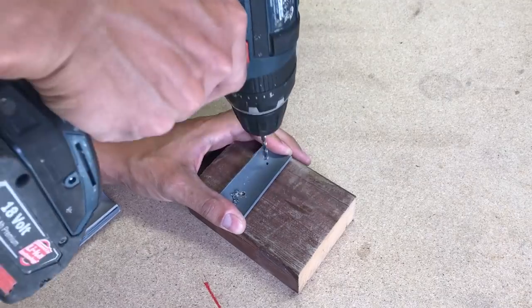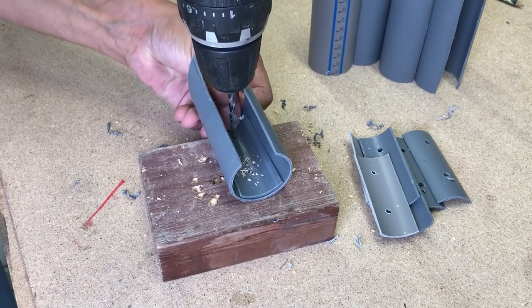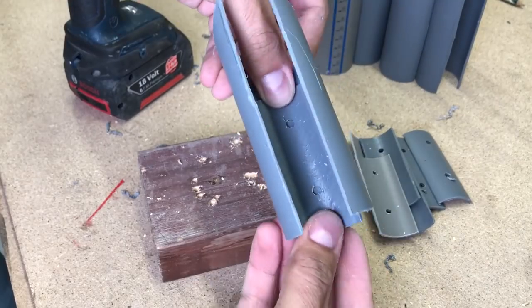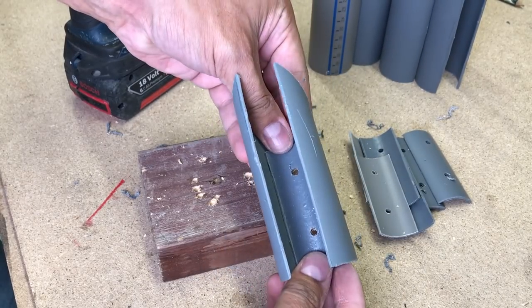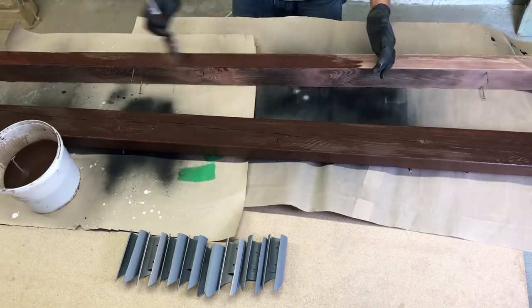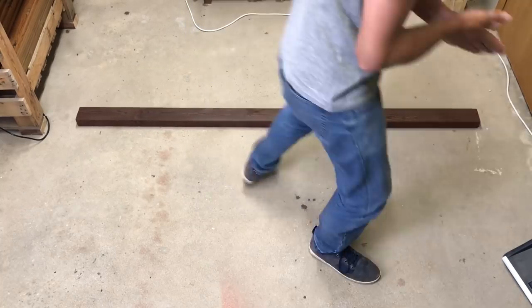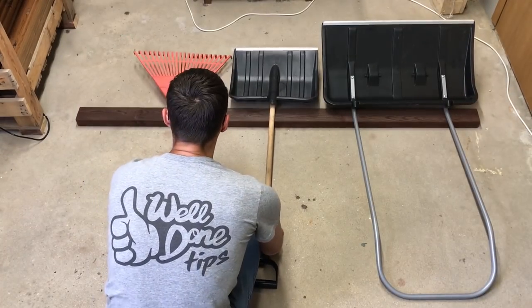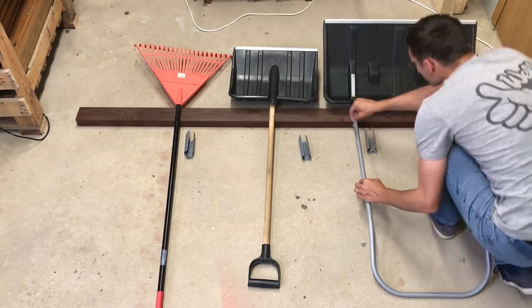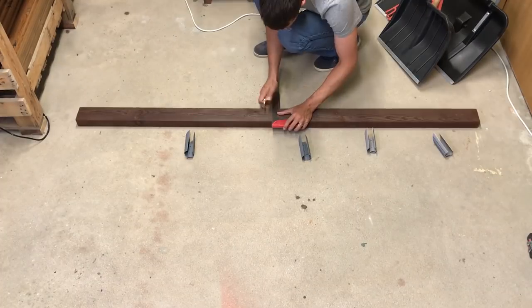From the slot off-cuts I made a washer plate to give more strength to the fixing points. I took two reclaimed 4x8 wood pieces and applied some colored wood oil for a better look. I put out all tools on the upper wood base, made rough marks, then found a center for each PVC holder, pre-drilled, and screwed them in place.